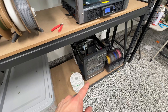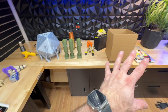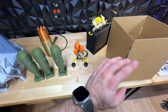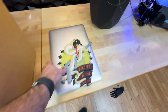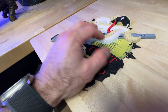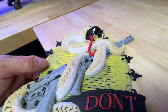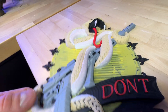Let's take a look at the placard we did, and also we got one model up on Etsy yesterday. I've laid out everything I need to add: the silver D20, the little boy atomic bombs, hollow points, some character models — I'm going to put everything on my Etsy. Here's the placard. Looking at it more closely, this was just a test print — I wanted to see how thick it was, how rigid, whether I need a finer layer height. It's basically solid, so I'll probably print the final ones completely solid.